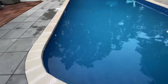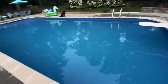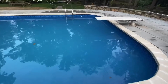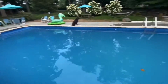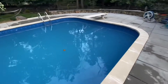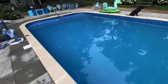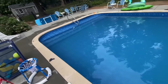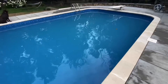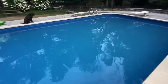I'm going to give this about 10 minutes to fully mix up. I threw the entire five pounds in because it's about a 33,000 gallon pool — 44 foot by 20 foot by eight foot deep. Tomorrow morning we'll do part two, but you can already see everything turning milky white, though it's hard to see clearly with the reflection and the lighting.